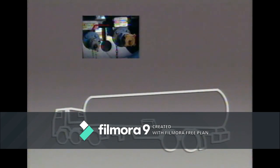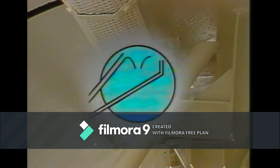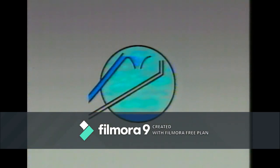Now, the product transfer equipment. Liquid and vapor connections are needed to allow loading and discharge of the vehicle. The hose couplings connect with pipes inside, leading to the top of the tank. As liquid enters the tank and the level rises, vapor can be drawn off from the top via the vapor return line. This reduces the back pressure against loading and allows the pump to fill the tanker more rapidly. The vapor return line should only be used where vehicles are filled by weight.